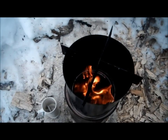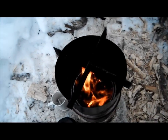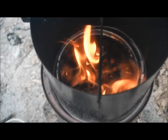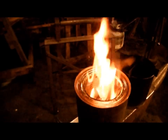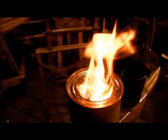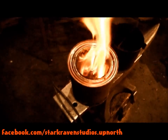Okay, a little bit about how this design works. The top-lit updraft, or TLUD design, was developed by Dr. Thomas Reed in 1985 as a small-scale gasifier — a way to extract combustible gases from biomass. So it's a wood gas stove. The idea is to separate the gas from the wood and burn it as a fuel in its own right. This results in a cleaner burn than you can get from burning wood and gas in the same space. From this perspective, charcoal is a by-product. Now, I'm using the same design principles, but I've turned the original purpose on its head. My purpose is to produce charcoal. The wood gas is a by-product.